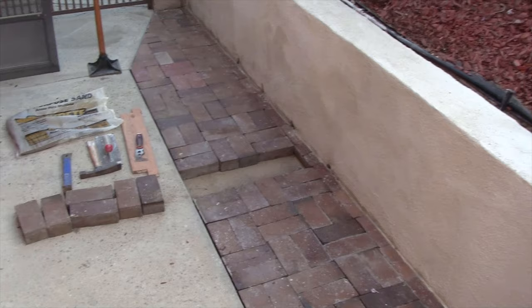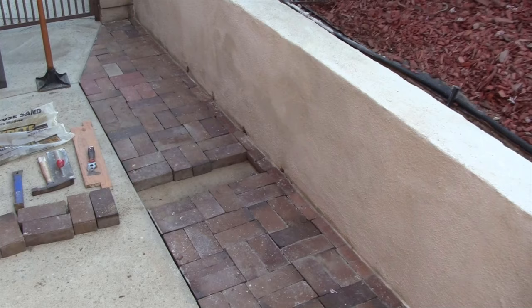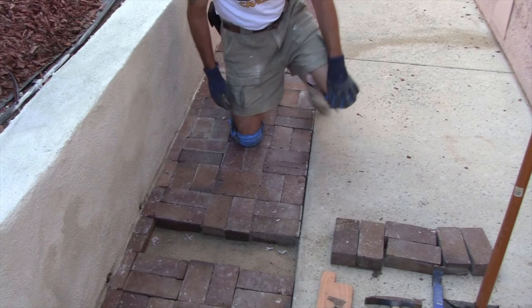There's a better picture of that 5-in-1 scraper I used to scrape off the sand that's on the existing brick. And we've got some all-purpose sand — a 50-pound bag — that we're using underneath the brick to give us the best leveling platform. So basically those are the tools. It's just a labor-intensive job. I've already started here and gone to here, and I'm going to work my way down and show you the procedure I'm doing. Okay, let's get into it.